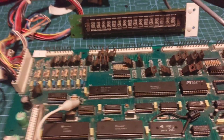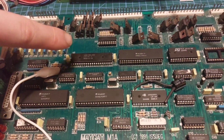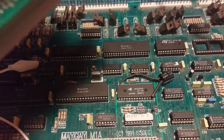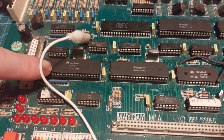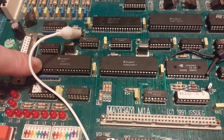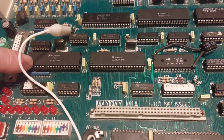Okay. Now. I put U3 straight down to the board. Solder points are actually very clean. Clean them up with some IPA anyway. Moved this capacitor over here a bit so the program card was set a bit flatter. No difference. Changed this chip out for another one because the writing printed on the front of the original was a little bit skew, which I found a little bit suspicious, but I don't know. Made no difference at all.